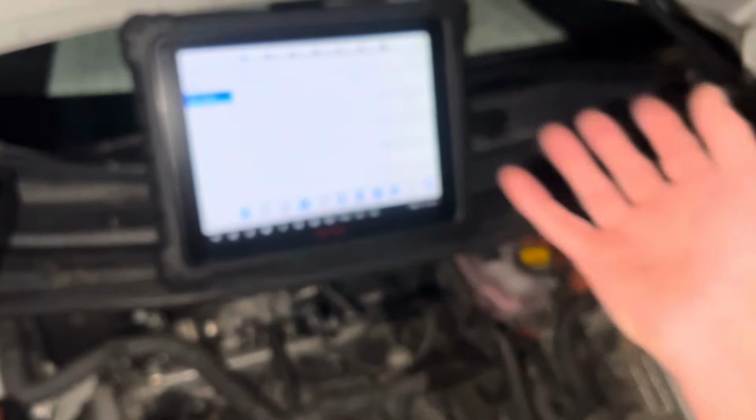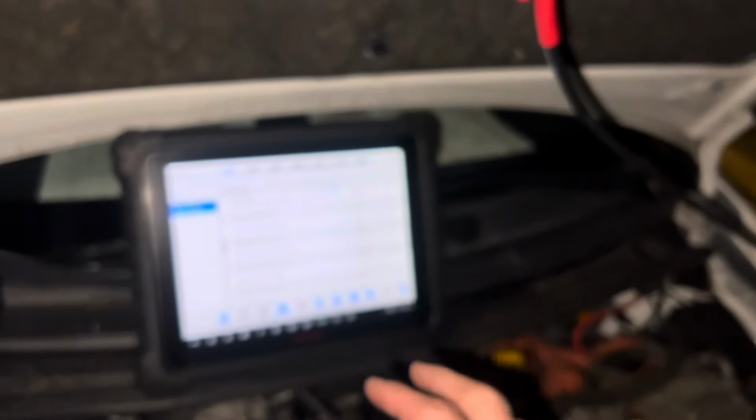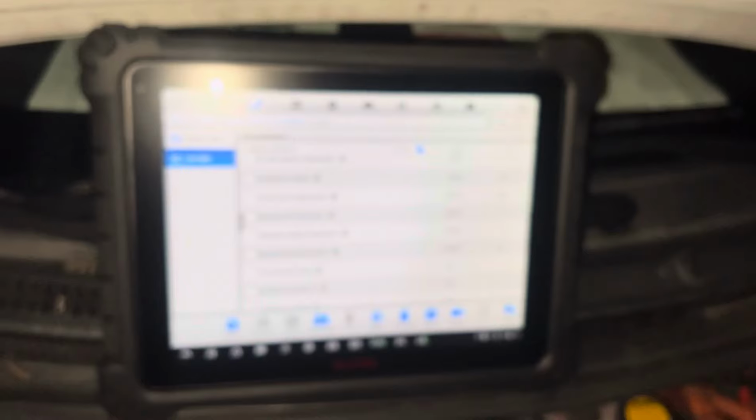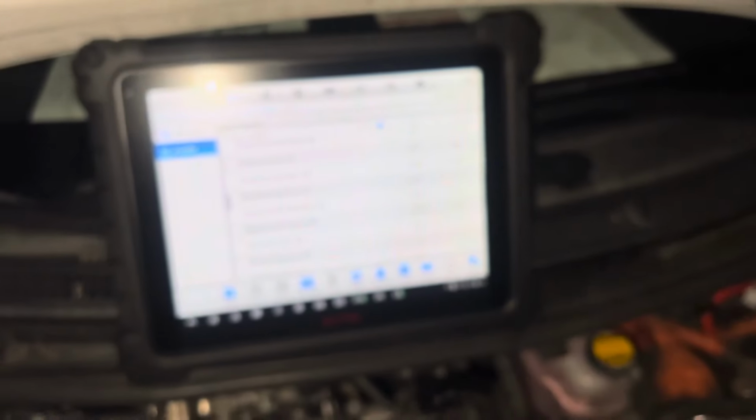So anytime you think you have a weak compressor, I hear these guys say weak compressor all the time and they replace their compressor. I'm not picking on anyone. I just get this question in a lot of replaced compressors because they think it's a weak compressor. If you have a full charge of refrigerant and you throw newspaper over the condenser and completely block the condenser and you're watching your pressure on your analog gauge, it doesn't matter if it's an analog gauge, you watch it go all the way up to 400 PSI, you got a strong compressor.